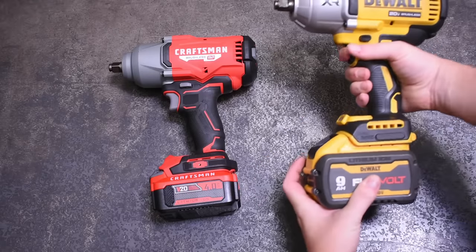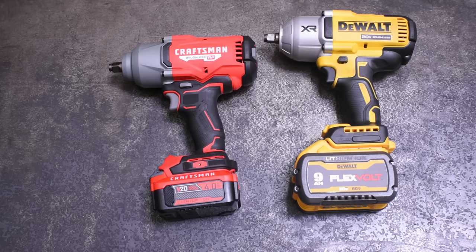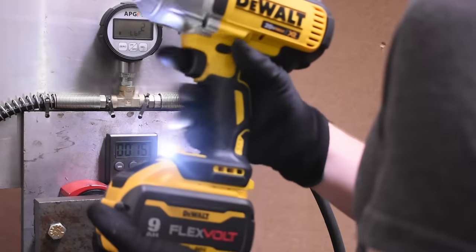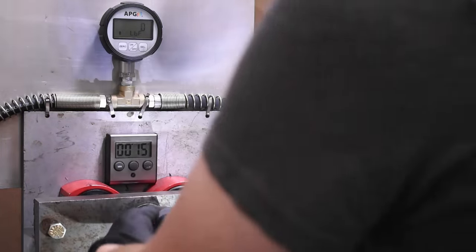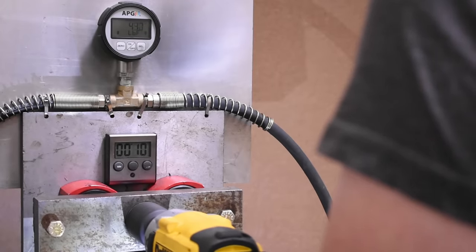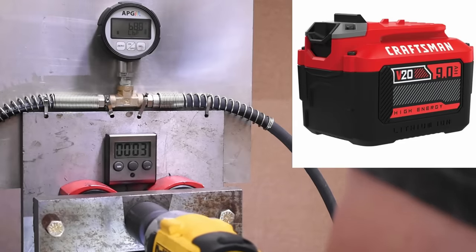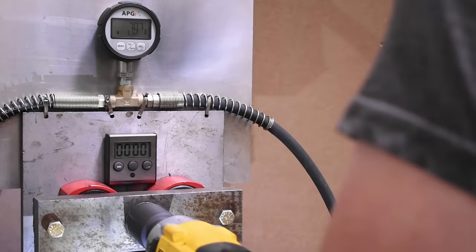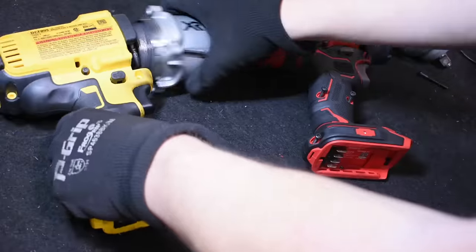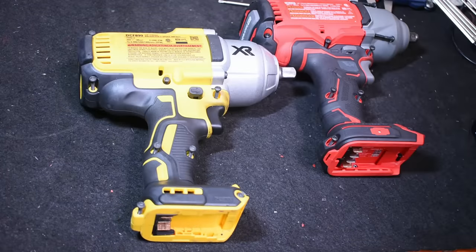In case you're holding on to your precious 899 and feel a tear forming — keep in mind DeWalt has a massive array of beastly batteries, like this 9Ah FlexVolt with 21700-size cells inside that we got with our 60V blower. The older 899 benefits a lot from these beefcake batteries, not that this is a rule you can apply to all tools. As shown here, it's surpassing the 670 of the Craftsman quite well. While Craftsman has a 9Ah battery that may close this gap, it uses traditional 18650 cells, so DeWalt's range of offerings still brings a lot to the table. Appreciate you joining us for this one — it's our aim to bring more cut-and-dry, repeatable numbers to the world of power tool specs. You can catch our attempts at least every Friday, and some bonus days like today, by clicking subscribe. Thanks for watching.